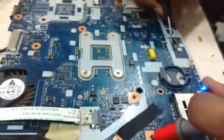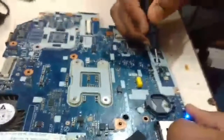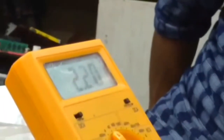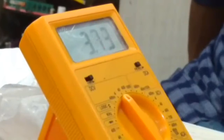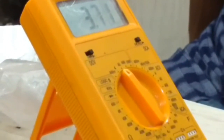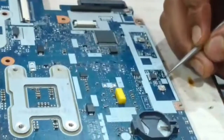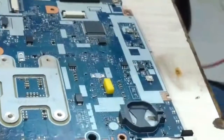This is PU22 and the drain has 5V always. Now I am going to check the voltage on the drain point — the drain has 5.5V. Now I am going to check the voltage on the source point, but the source has only 2.2V. And the gate has 3.67V something. So I am going to change this MOSFET and check the response. PU22 is an N-type MOSFET.